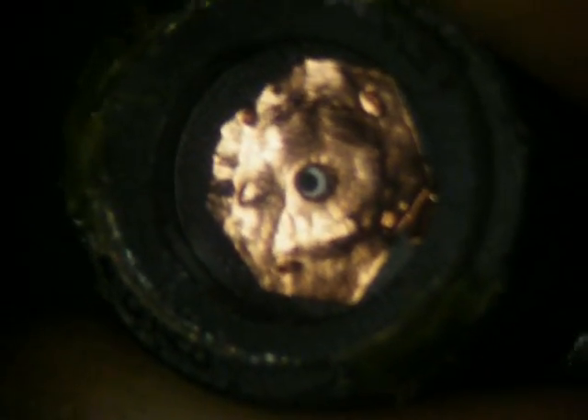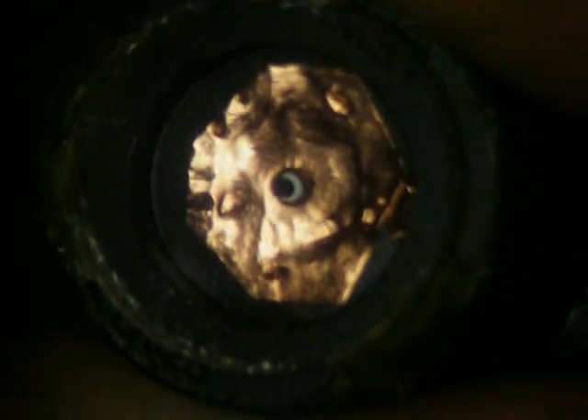It's not a pinhole — it's just a hole. It's larger than a pinhole and not working like a pinhole. I put it back on the lens closest to the imager, and it seems to really clean things up a lot. It's underneath the IR block filter, because if I put it on the IR block filter it worked, but you got vignetting — the corners were now dark and shadowy. But they're in focus, which was nice.